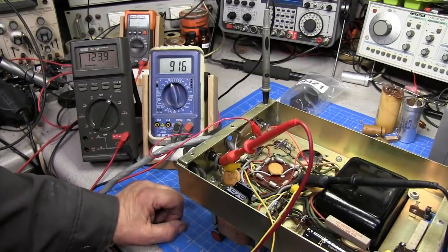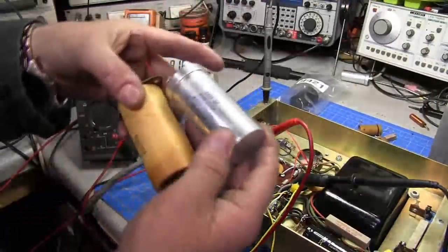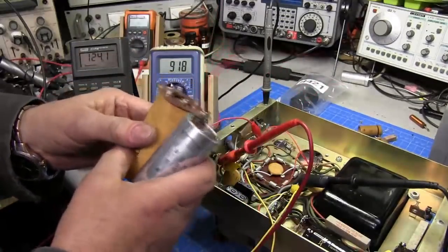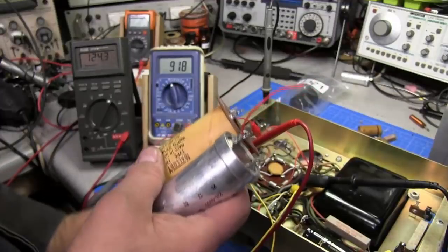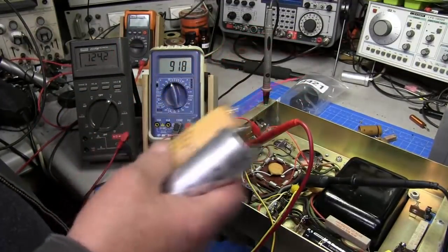And that shows you now with two capacitors that was originally in here. That one's 500 volts and this one's 500 volts. That's only 1,000 volts of headroom, of total voltage that these two capacitors can hold. So we're less than 100 volts on the headroom.